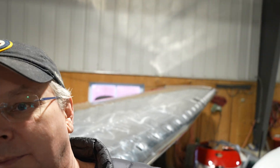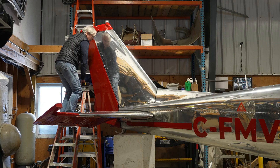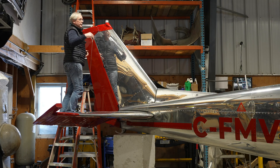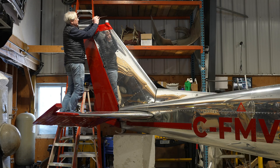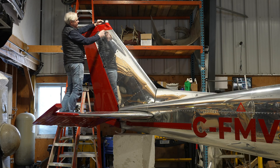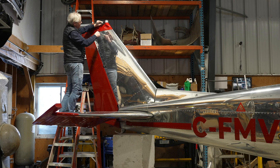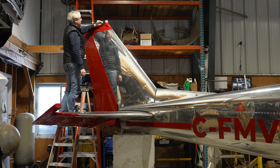So I need to put in the two new antennas here, plus the antenna that's going — where is the top of the back of the airplane? There it is. Up at the top is the NAV antenna, and that's for the ILS and localizer. At the top of the tail I have to mount this NAV antenna underneath the cap, so I'm going to have to take the cap off, cut a slot, and attach it to the top of the fin.